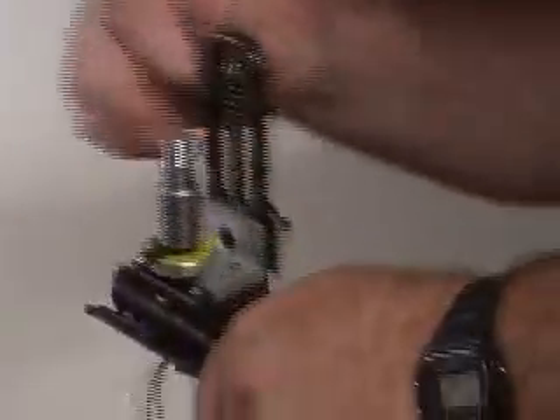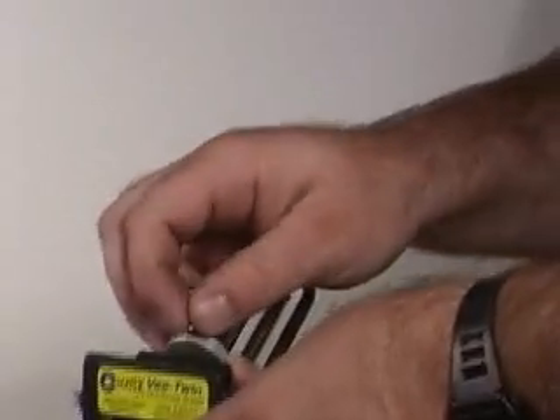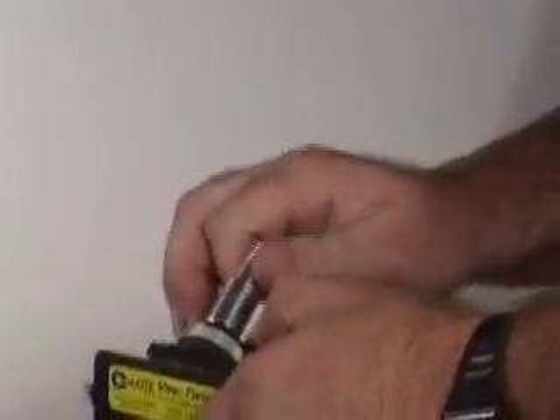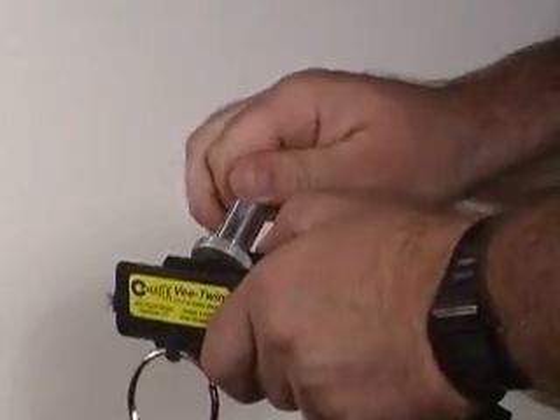Simply rotate around probably two or three times — this cable's pretty easy to do. Now what you're going to do is back this top knob out, pull the blade up, then turn it 90 degrees. Then by turning this knob back down again, you're pushing the cable in.